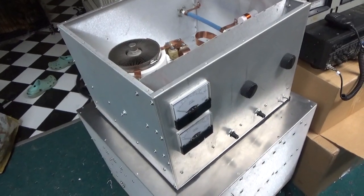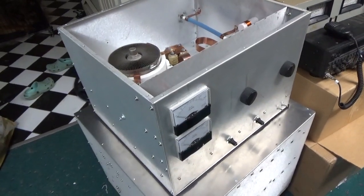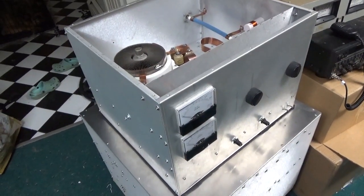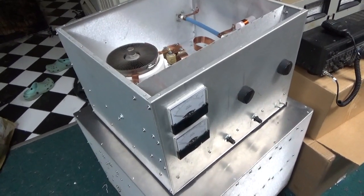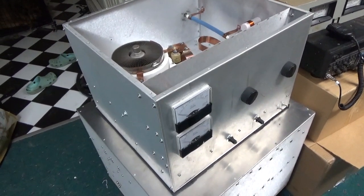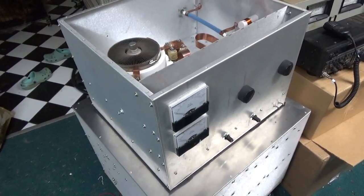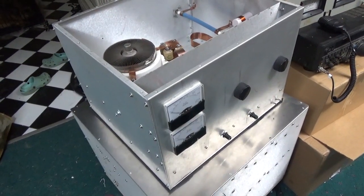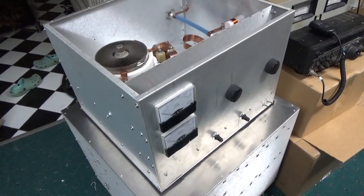These relays open at like 12 or 13 volts — it's real low. Now the voltage, worst case, will creep up. I measured about 27 volts. I left it keyed for like 8 minutes straight and then it levels off. So remember, if you're going to put that type of circuit in, you don't want to damage the coils of the relays, especially expensive relays.